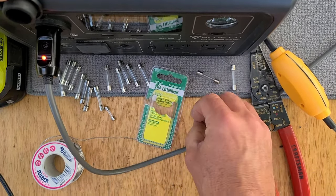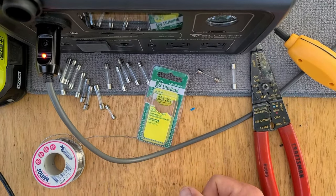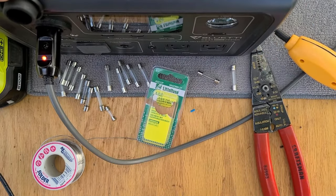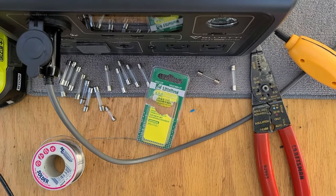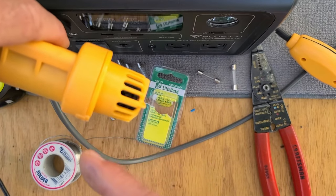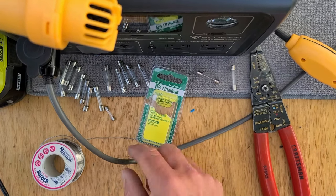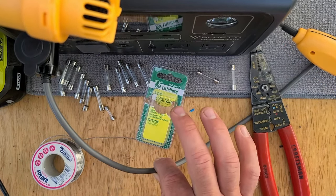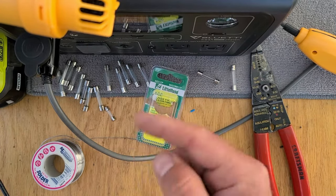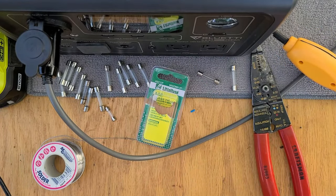The light is still on and we're running — one-amp fuse instead of the 20-amp fuse. So if something was to happen — if I was to nick the wire — I'd blow the fuse. Hopefully I wouldn't burn up my solar generator, my Bluetti. Hopefully we don't burn up the motor either. Even if something was to happen inside the motor and a piece of dirt got stuck in the propeller and stalled it out, hopefully we would blow the fuse first. So not only did I make the fuse small enough to protect the wire — which I think would be about 5 amps — I went even smaller, so hopefully the motor will last even longer. That was a simple fix.